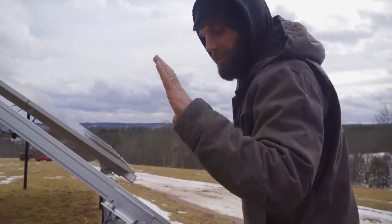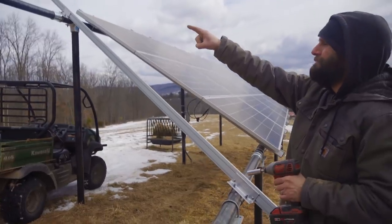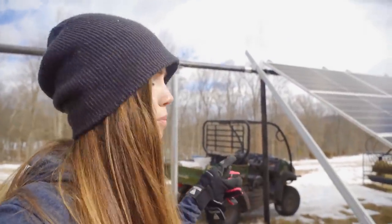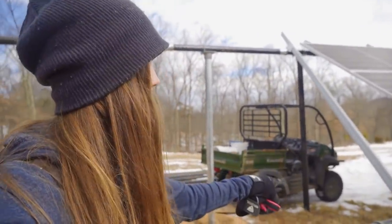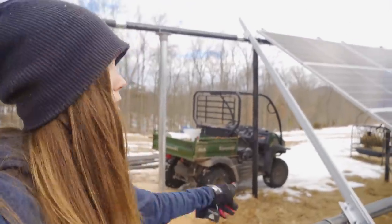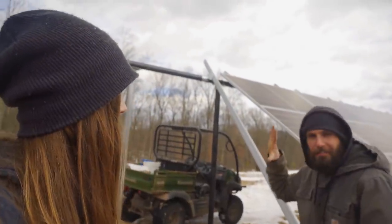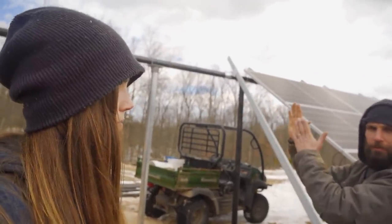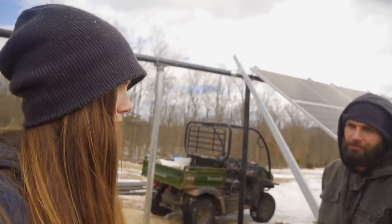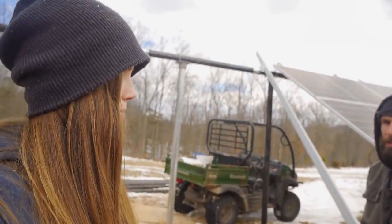So since this is going to be rigid and sturdy, we can come off of here and come up and catch that guy right there, and we should be able to make everything nice and tight. We're just using the rails to temporarily brace the new stanchion that we're building on. The one that is up right now going at an angle is coming from the new ones that are not in concrete to the fixed one over here to keep it all stiff. Correct. Then we're gonna come off this because this side is fixed now, since it's attached to that. We'll come up at an angle and get that side fixed, then go straight down to get everything sturdy. Then we will pour the concrete, and once it sits up, we will take everything down and start making it permanent, and put panels up. Yes.